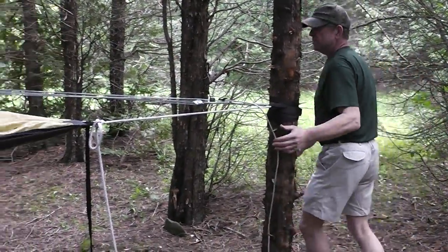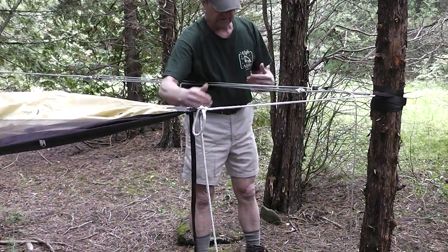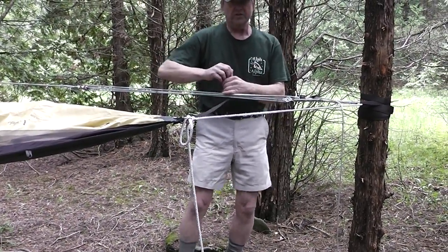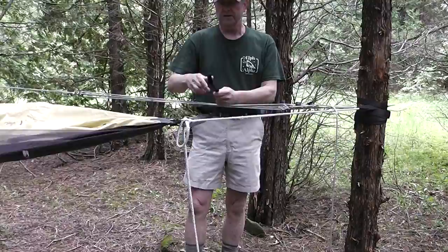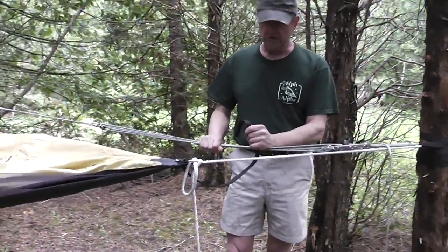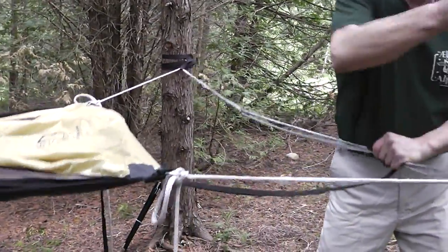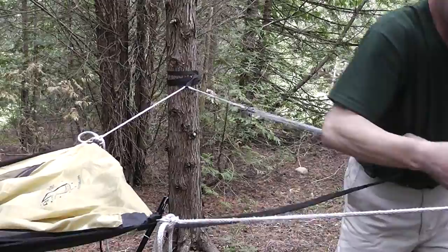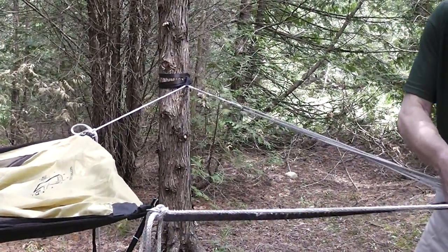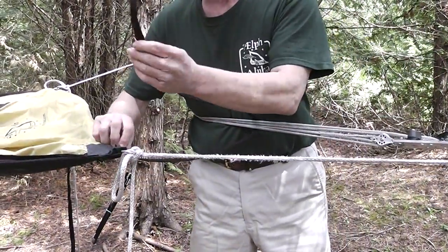Now, before we tension it completely up, you can set these, we've got pretty good distance today. It can be any distance that you can reach. If you have a lot of distance, you're going to have to put more muscle into installing the D-ring straps. But if you put them on before you've arrived at full tension, I could even slack off a little bit here. I can install these after full tension is on, or again, when it's a long way to go, I can get it now before the tension's strong.